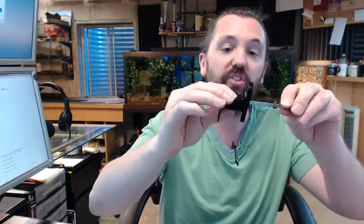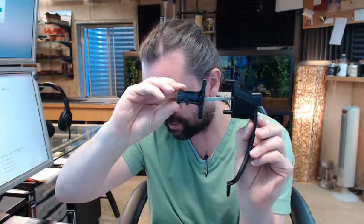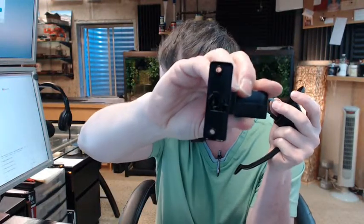So after you get this there, holding it to the outside of the door, insert this, and then maybe have somebody mark off where you need to be for 3/16 to 5/16 projection out of the other side. And that is because it needs to communicate with the inside latch, and it will only tolerate going in so far before it will not work properly. So that's what that'll look like, obviously. Depress push button and guide spindle into rectangular slot and locking bolt. That would be what they're referring to here. Then attach everything with your machine screws as indicated before.